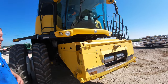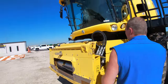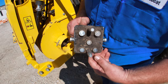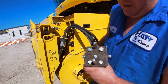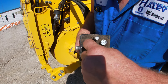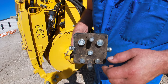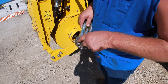For the quick connect hydraulics, always wipe off the fittings on both the combine and the head before you couple them up. If there's dirt on them, the pins get stuck and dirt gets packed in - when you uncouple it, it'll eventually blow the seal out because the pins aren't moving as far as they need to. You cannot replace just that little seal; you've got to get the whole stem that threads into the block.